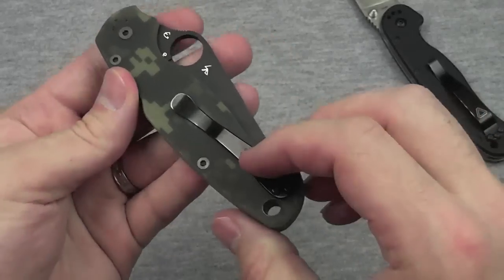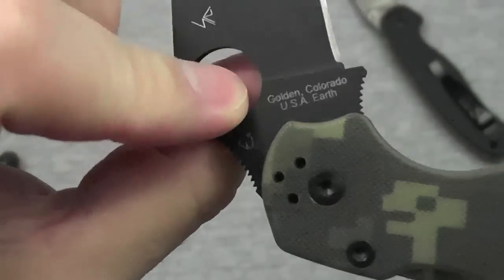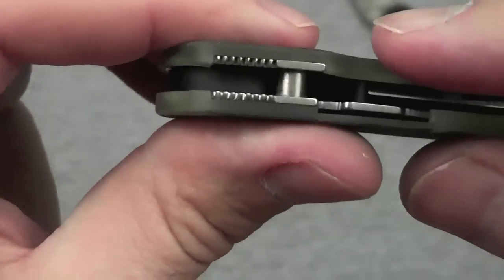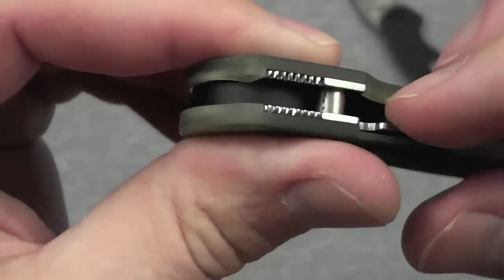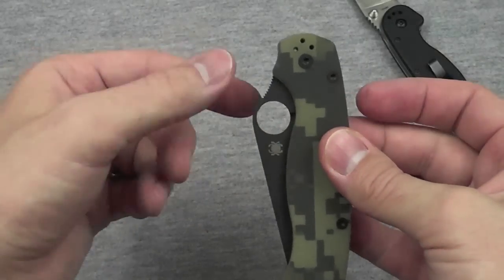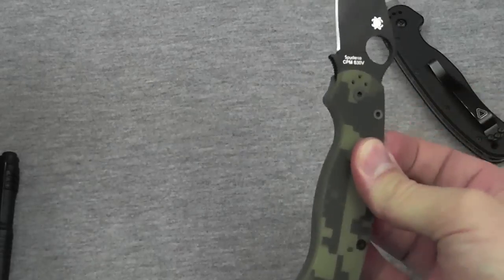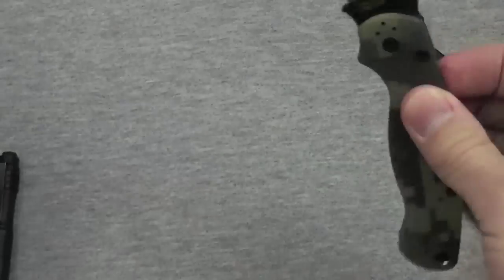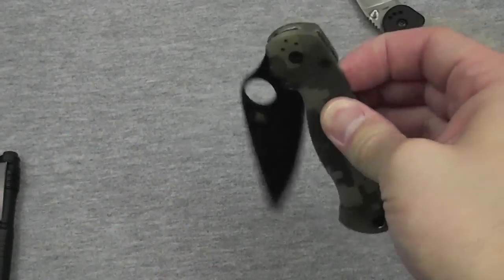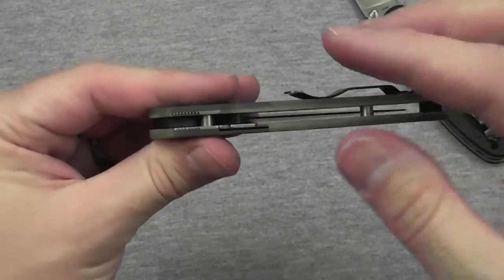I will give it a little hit though — let me show you. That's the actual sort of hilt of the blade, this part right here, and it comes all the way up to there. If your finger fat is kind of down in there a little bit, you're going to feel that thing when it slams back in. It may stop it from actually engaging with the ball detent and getting locked in place. I've noticed that a few times — if my finger is digging in just the right way and going deep, when I go to close it, this kind of dull point hits my finger, it bounces back out, and it doesn't close all the way.